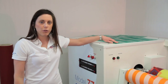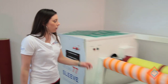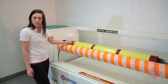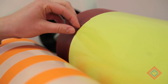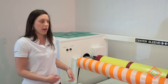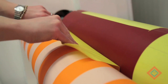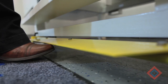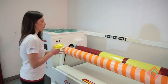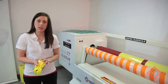Now that our three plates have been removed from the sleeve, we can do the same process with the sticky back. I'm going to rotate the drum here, find the edge of my tape, peel it back, and use the assist roller just like I did on the plates to remove the sticky back clean in one piece from the sleeve. Okay, so that was easy. First one's done — on to the other two.